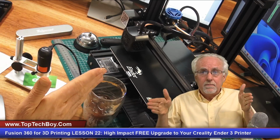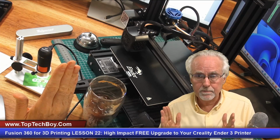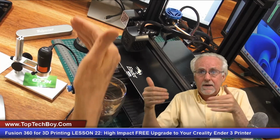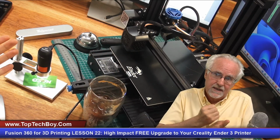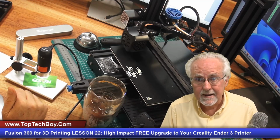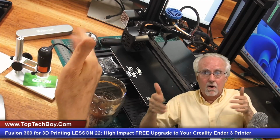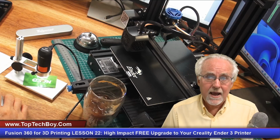But if we want to begin to do bigger prints that occupy a larger portion of the print bed, then this doesn't work, because now it's good in the middle, but as we get out towards the edges, we have trouble extruding because that extruder, that nozzle, is actually sitting on the print bed. And so there is no way to get it where you can properly get that first layer down all the way across the base.